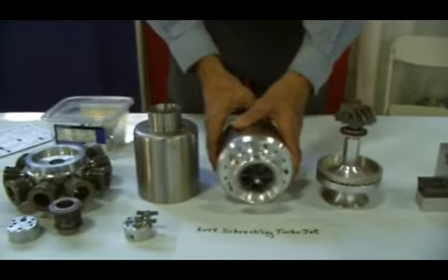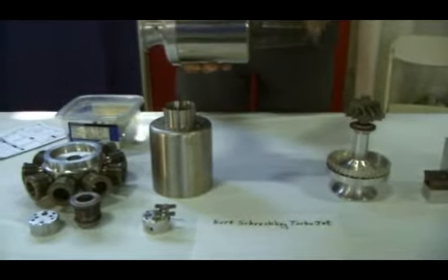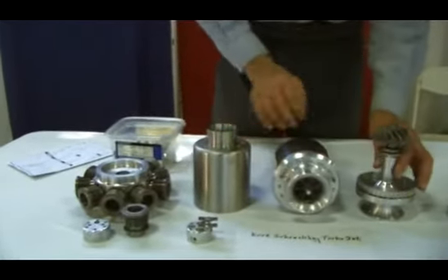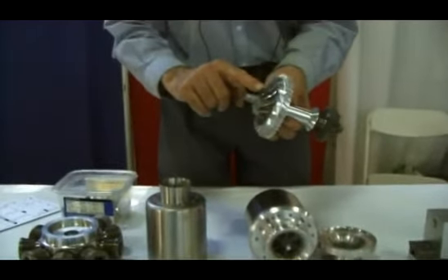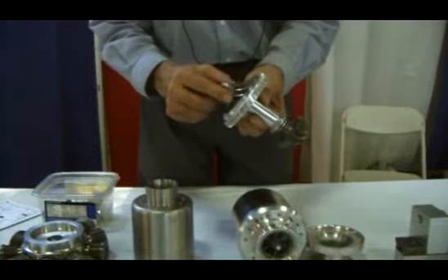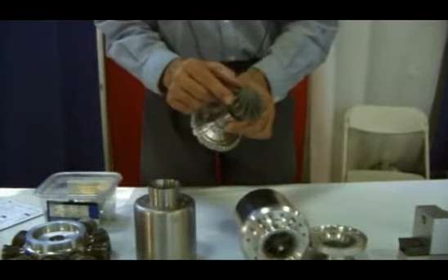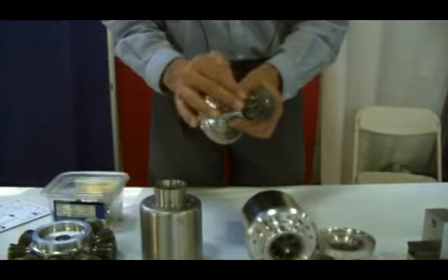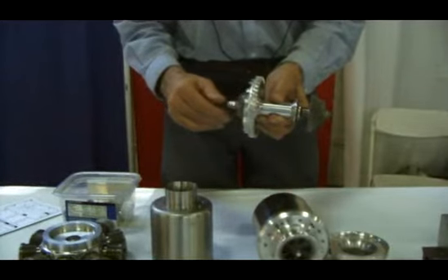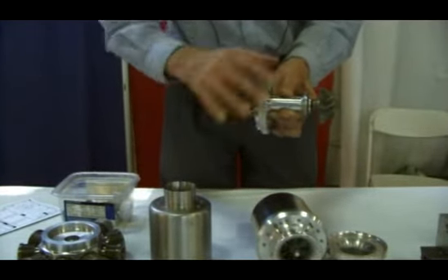This is a working model of a turbojet engine based on Kurt Schreckling's design. This one has run — you can see the heat discoloration on the exhaust end. Some internal parts you can't really make yourself; the parts that move are the rotors from a diesel turbocharger, which are precision cast and precision balanced at the factory. The hot rotor is made out of the same Inconel alloy that full-size jet engine turbine blades are made from. For this diameter, it'll spin at maybe 120 to 130,000 RPM. That's another reason you don't want to make them yourself — you want that factory-made, factory-balanced rotor. But you get to machine all the rest of it yourself.